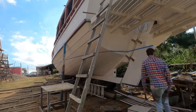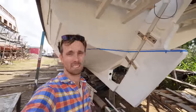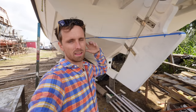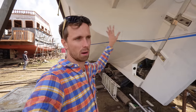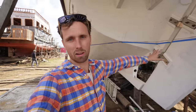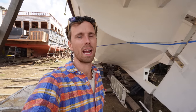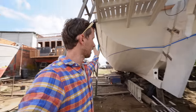After many days of testing, drawing, measuring, removing the drawing, putting tape, removing the tape, sulking because it wasn't working, and reflecting on how it can be done better — we finally got ourselves a straight waterline. It looks funny from down here, looks really wrong, but if you're actually out at the level of the waterline it's nice and straight. That's how it should be. Thanks to everyone who was involved with this. The next step is to sand the Vince epoxy — which was the last layer we put on top — make it nice and smooth, then apply the polyurethane primer and polyurethane paint. Very important: do not sand the line we just drew. We'll sand right above it by machine and the line itself by hand, so we can then start applying the final paint above the waterline. The antifouling will go on just before we launch. First waterline I've ever drawn — hopefully the last one. Let's get sanding and painting!